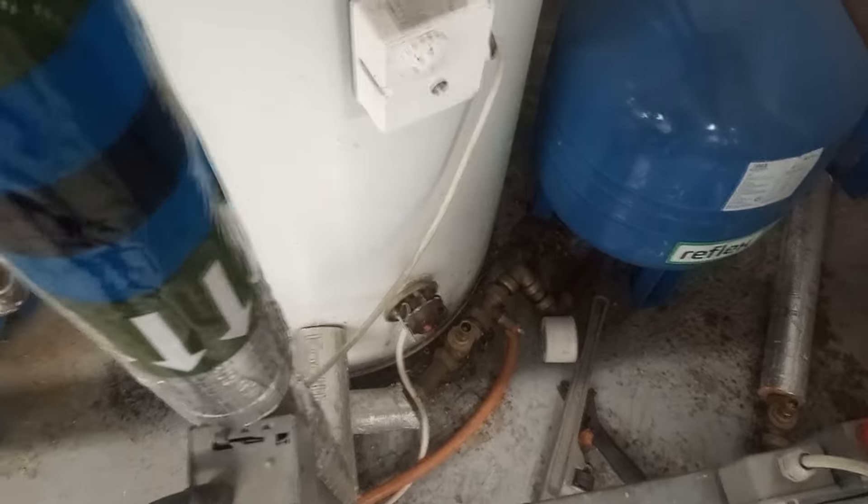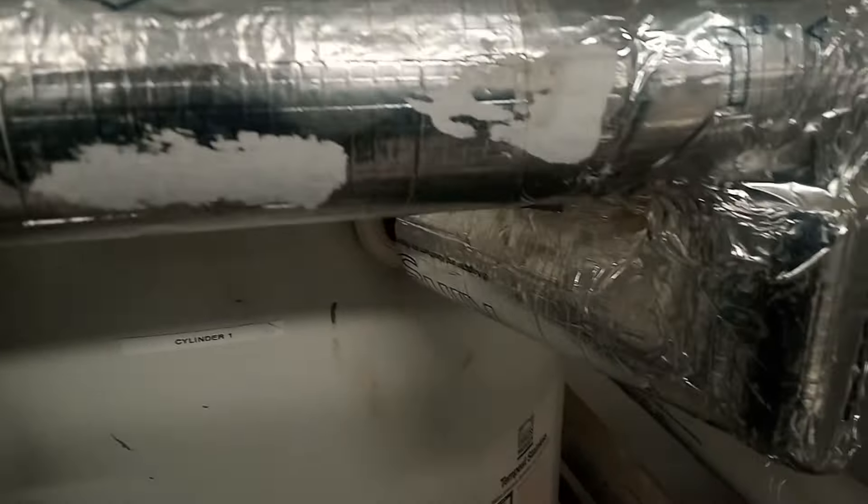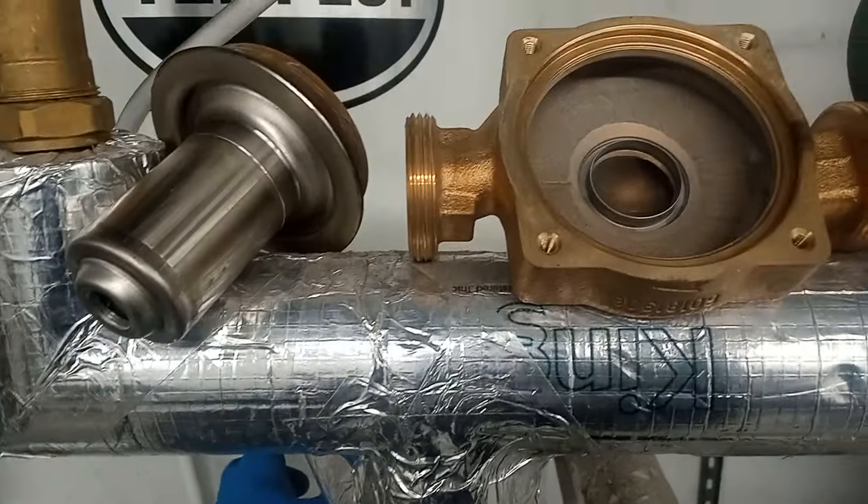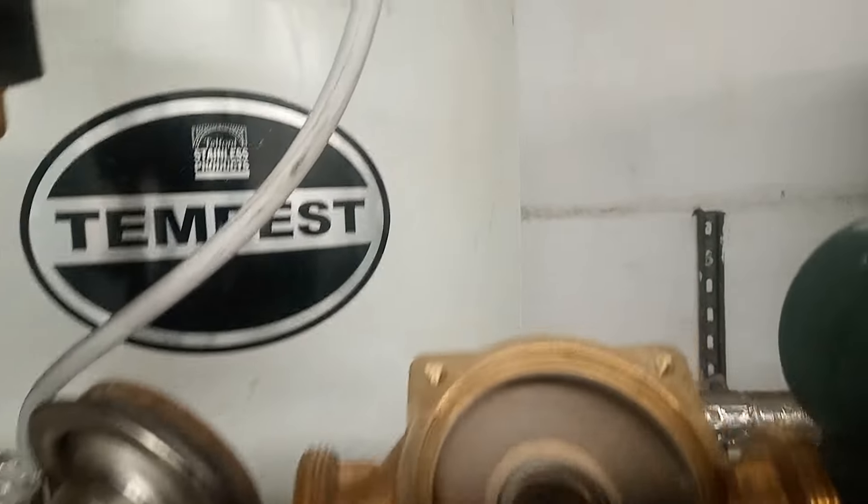I have to cancel this task because, just as I thought, the valves have been done in a strange way. I cannot do one cylinder at a time — I have to drain the whole system down. As you can see, the return is going into each cylinder, and unless I shut off the hot water draw-off I'm going to get a mixture. Despite draining for a good 10 minutes or more, I still have a lot of water in the system.